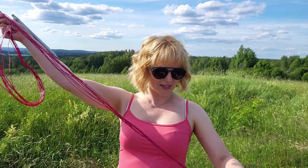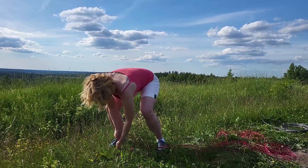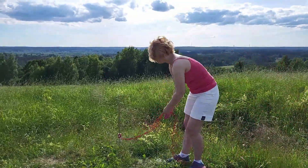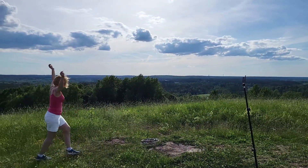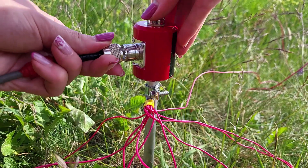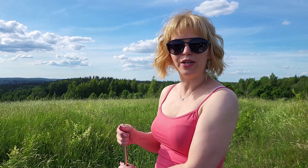First one is a ground plane, and the most tricky thing is the radials. Ground plane is a very popular model of antenna. Since I'm not doing an elevated GP, I need many radials and it is a difficult part of setup because it takes much time. The radials are on the ground, but I need to tune the vertical part of my antenna for exactly the band that I need.